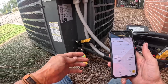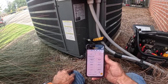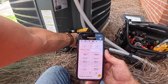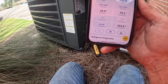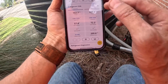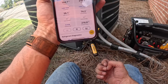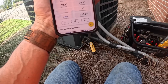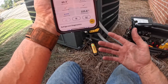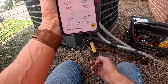Sorry y'all couldn't see some of what I was doing. Head pressure is going to have to build — I'm going to explain something that's about to happen. Right now there's ice on the coil and it's keeping head pressure from building. That ice that is touching the coil will melt and then it's going to have like a hollow space where there's no ice — maybe just a little bit of water — but there's ice all around where it was touching, preventing airflow, so this pressure here will start to go up.